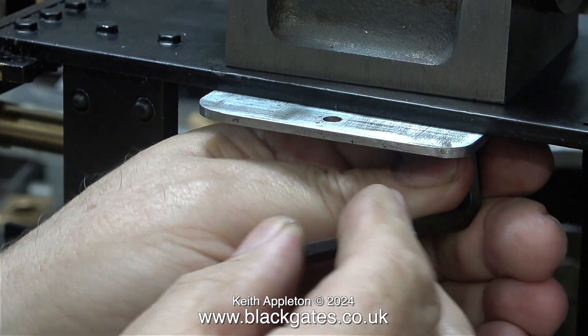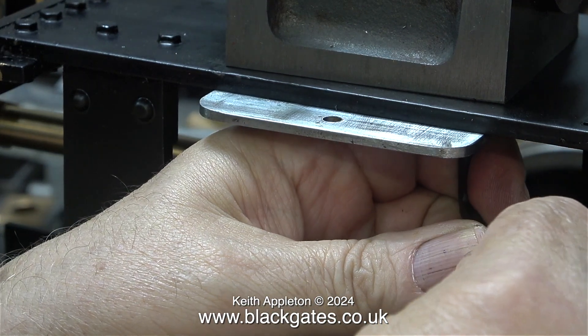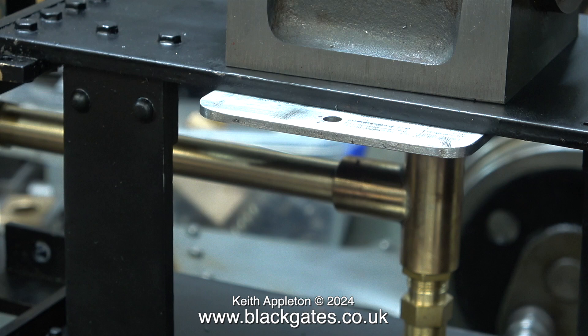Some viewers will be thinking why haven't I painted the mounting brackets for the cross shaft for the cylinder drains. There is a valid reason: had I painted these brackets they would have fitted perfectly and looked better, but if I were to remove the cylinders at a future time the paint layers would be stuck together and damage the paint on the frames and on the brackets. I will of course be painting these mounting brackets using etching primer followed by satin black paint, but I'm going to paint them with a brush rather than spray them.